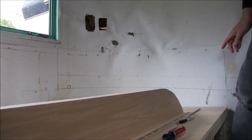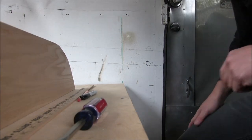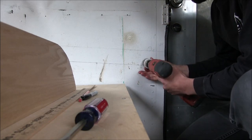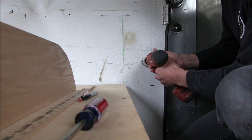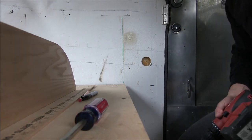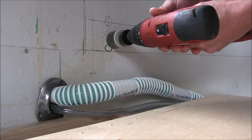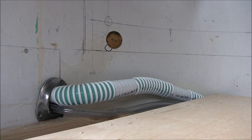Now what I have to do is drill a hole in the corners here — that will allow me to get the shears to make the turn I need. I can only cut here because there's a rib structure right here. Put on my safety glasses. You've got to be careful — you don't want to drill through wires and you don't want to drill outside of the trailer. Run it backwards first, then forward. Okay, there's the hole there. Now I'm going to drill another hole up front — same thing, I'll line it up. Backwards, then forward. There's the hole we needed.